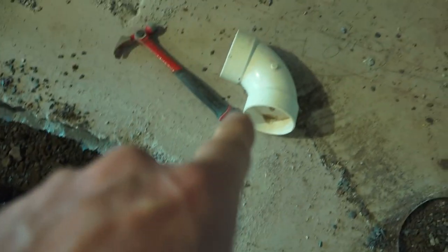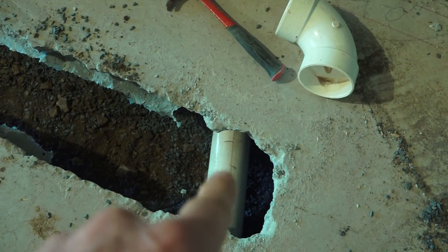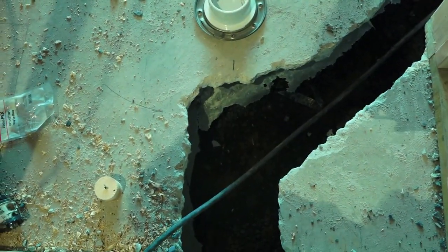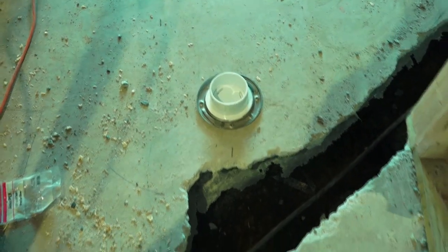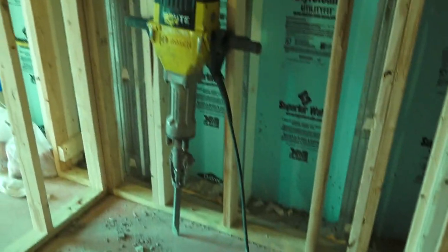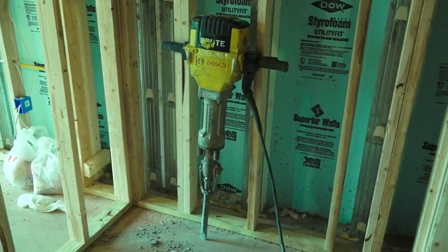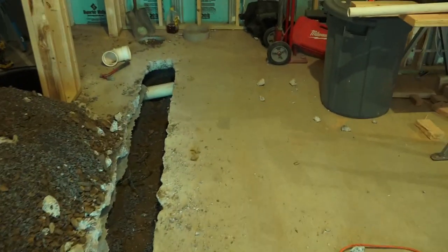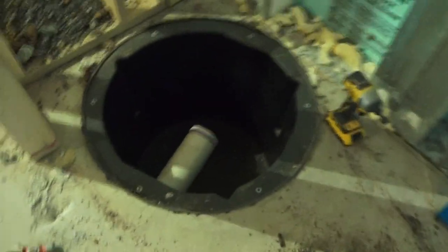So we're keeping the pit and we're keeping that section of four-inch pipe right to this point here. Now we're going to cut it right there and we're going to use some fittings to turn the plumbing into our trench, and then we're going to shoot it up here to the bathroom toilet, which is going to be right there. We're going to put our flange right down there — we're getting ready to put this together this morning. You can also see that from the toilet location we've jacked over to where our shower drain's going to be. We used the jackhammer this morning to open up the floor from the shower to the toilet all the way down to the existing sewage ejector four-inch pipe, and we're going to tie in right there.